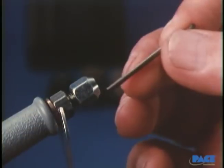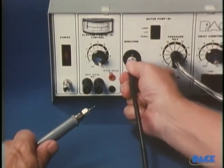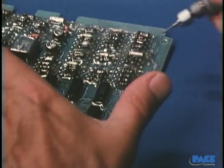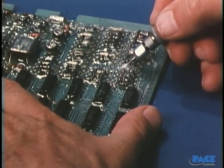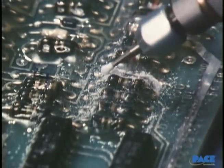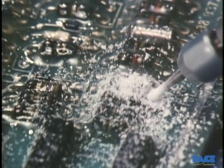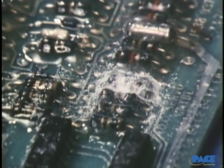An alternate method for attacking hard thick coatings is miniature machining using ball mills. This system provides low RPM and high torque, and you can manipulate it quite easily. Notice how the side of the ball mill is used — that's the most efficient cutting area, not the end of it. The object is not to remove all of the coating; you could easily damage the board or circuitry that way. You want to just thin it down. The strategy is always to go first from thick to thin, using thermal parting or machining to get most of the coating off. Never attempt to actually reach the surface this way. And another caution: don't use soldering irons for this work, even ones with modified tips — high temperatures and sharp edges can damage the board.